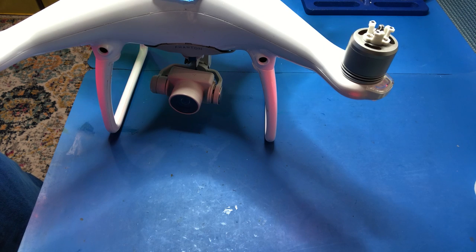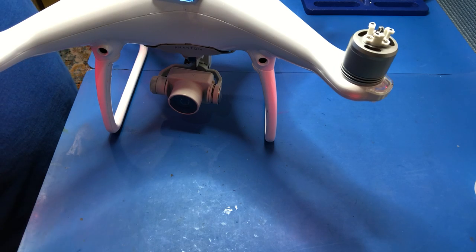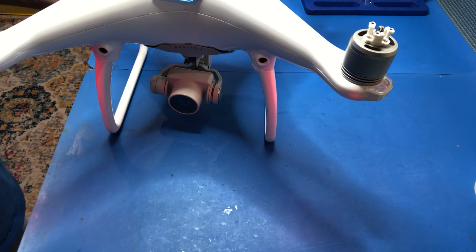As you can see, it now points straight forward — we're all done. It only took one try. This is the method: if the casing is damaged, you may be able to use a compass and find where the mark was on the original. If it's damaged so badly you can't do that, you can just try one, see where it points, mark it, and then try several other casings. You'll find the one that lines up. It's a fairly easy method versus just replacing casings randomly. Again, this is DroneTed — thanks for watching.